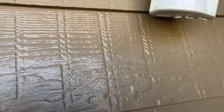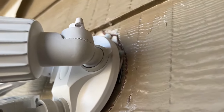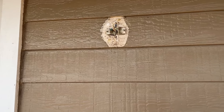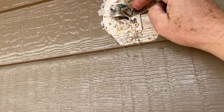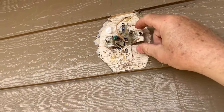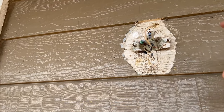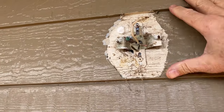So I'm putting it up and you can tell where the old one was. There's a lot of caulk, so I've got to paint it and caulk it. But if you look back here, there's not enough room in this little bitty plate to go on the wall. Because when they built the house, or whoever added these wires, they just put the two wires through — no ground, I might add. Actually, there is a ground there. So they put the two wires through and there's just a metal piece, just a hole in this concrete siding.